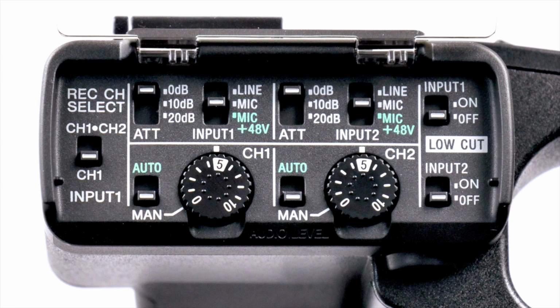My way of thinking is if you had the button set to the top option, you'd have channel 1 coming on channel 1 and channel 2 coming on channel 2, so you'd have the discrete audios coming in. But no, it's the other way around. With it down on channel 1, that means it goes just to channel 1 and channel 2 gets its own audio. So it's almost like it's back to front. I don't know whether that's an error or a bug or whether that needs to be changed in firmware, but that's definitely counterintuitive as far as I can see.